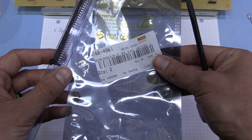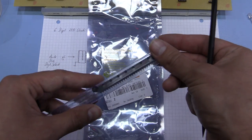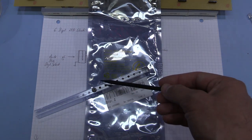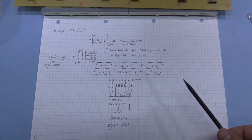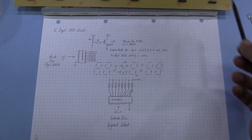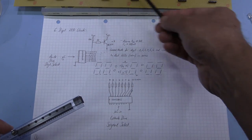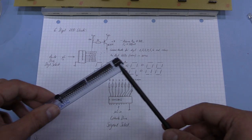I've found a couple of PIC 18F26K20s — 8-bit microcontrollers with an internal oscillator running up to 64 MHz with the PLL, and two pins for attaching a 32.768 kHz watch crystal for real-time clock functions. It has more than enough pins: we need eight for driving segments and seven for driving digits, plus a couple more for tactile switches to set the time (even though I'll eventually drive this from GPS), plus programming pins and power pins — 28 pins should be just about enough. I'll decide how to wire this up, solder it onto the board, update the diagram, and then think about the power supply before starting to program.